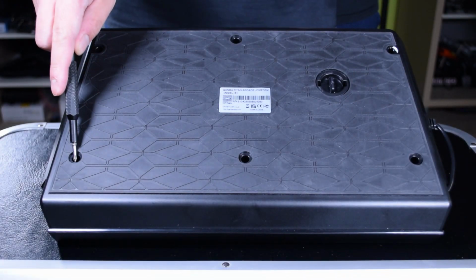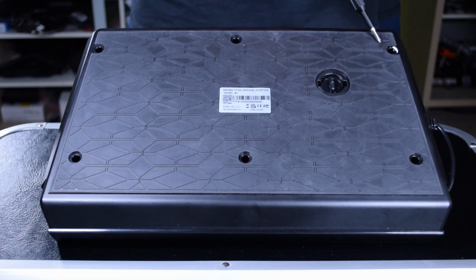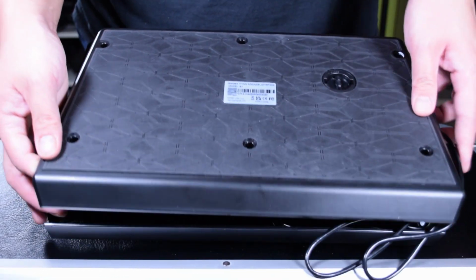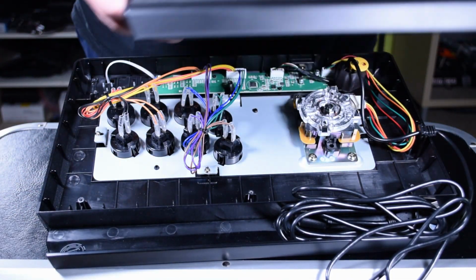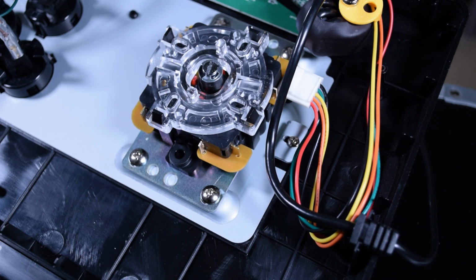When opening the Titan for parts modding, it's pretty simple as you need to take out the 6 screws found on the bottom of the stick. This includes the top right, which can void the warranty if tampered. If you've modified either the Crystal or Obsidian from last gen, you could expect the same here when it comes to parts replacement. The buttonholes are 30mm, and steel snap-ins or screw-ins from Sanwa, Seimitsu, Crown, Gamerfinger, and even Qanba themselves should work. For the lever side, it uses Qanba's own 4-hole mounting system.